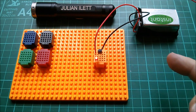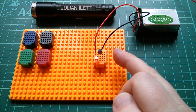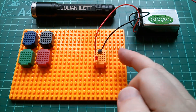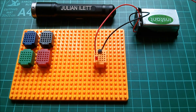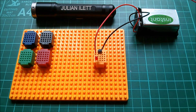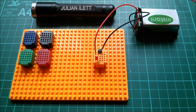If I induce a positive voltage — which is quite hard to do because as soon as you get a positive voltage on the P gate junction it starts to conduct — I can just for very brief moments slightly enhance that N-channel. But it's very easy to get a negative potential sitting on that gate because now the junction is reverse biased: it's a very very high resistance, multi mega-ohms probably, which does leak away very slowly and the N-channel starts to conduct again.